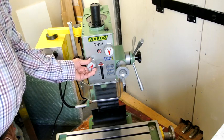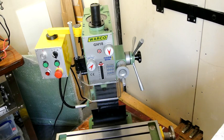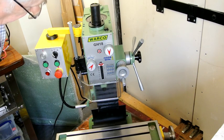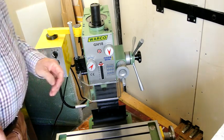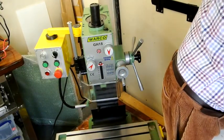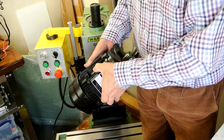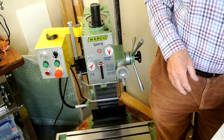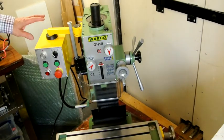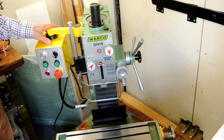These are the controls that operate the gearing and its RPMs are really rather too low. It ranges from 95 to 1420 using this enormously heavy bulky motor which I've just taken off. I won't reuse that and I'll replace it with a treadmill 180 volt DC motor, which will enable me to strip out everything in this box and install the DC motor speed controller unit.